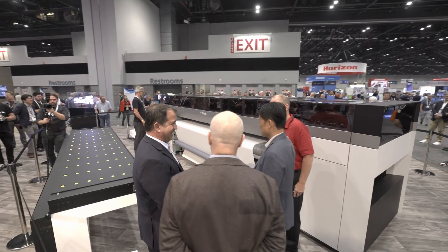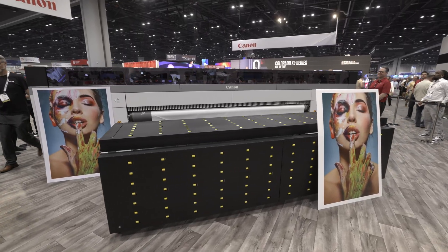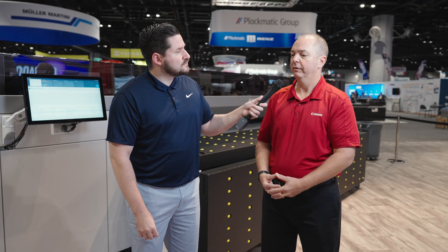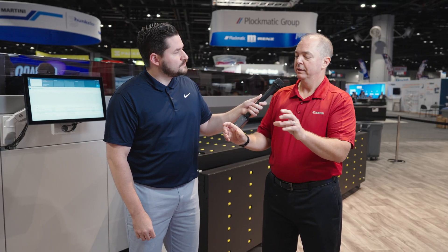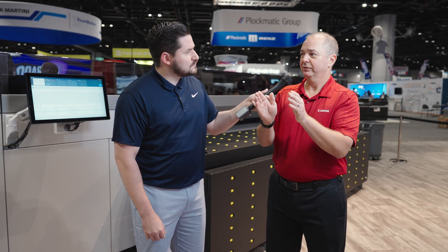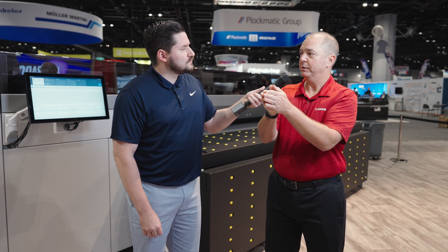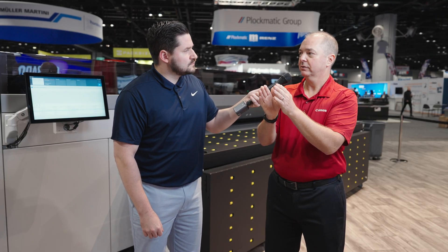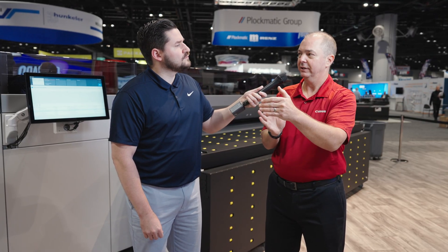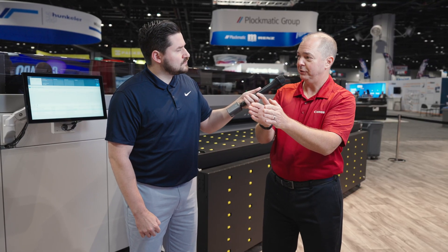What is your personal favorite feature of the Canon XL? I think DMC — dynamic motion control. It's just amazing. Most machines have an encoder wheel and a drive wheel driving the belt, and with the weight of the rolls you have on there, sometimes there's too much momentum to get extremely accurate positioning at full speed. But dynamic motion control steps in and takes it that last mile, doing that little bit of correction it needs to run at a higher print speed than you normally could. That technology is so unique — I haven't seen it anywhere else. We're actually moving the print heads in the chassis, monitoring the movement of the media with machine vision inside the machine, watching how the media is moving and compensating live while it's printing, in the middle of a job.